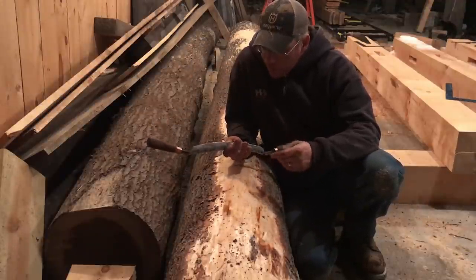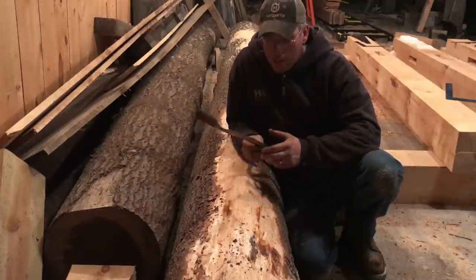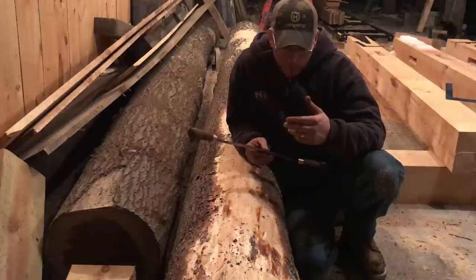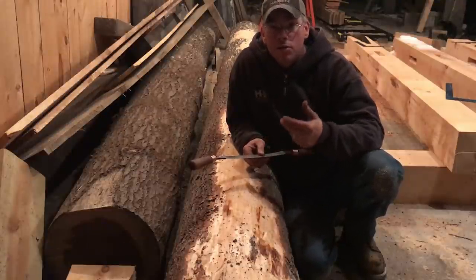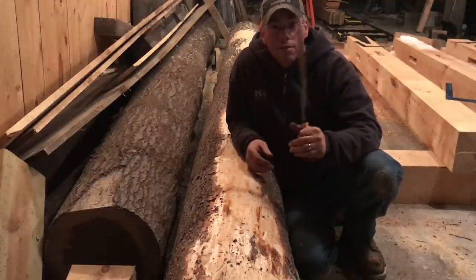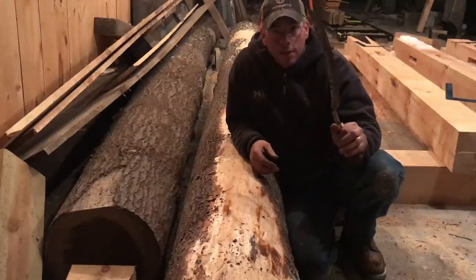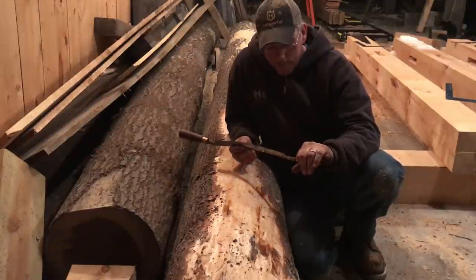Well, after you do your rough grinding, you never take it all the way down, because that edge will get so thin, it's likely to crack on you in a quench. So after you grind it out and all that, for this 1080 steel, I had to quench it twice. That means get the whole cutting edge above magnetic, twice, quench it twice, and then for this kind of steel, it can go in the oven at 400 degrees for an hour. And that's what I did.